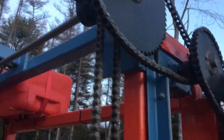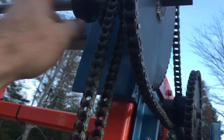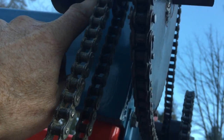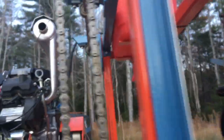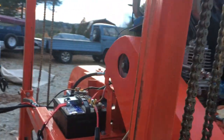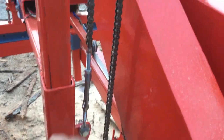I have a three-quarter inch shaft that runs end to end. The mistake I made is I didn't clock these small sprockets exactly the same — this one I welded on and it didn't make a difference. They're on a key, so right now this one is about a half-tooth backwards. This chain is fairly tight and the other chain is a little sloppy. I've taken the slack over the backside — makes no difference — but I have lots of adjustments.